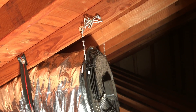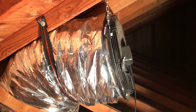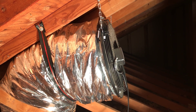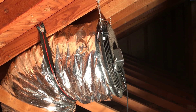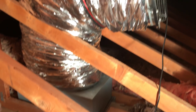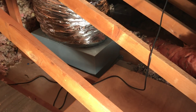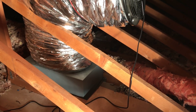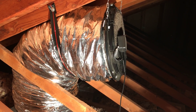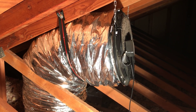As you can see, the fan is suspended — there's a chain here and a strap. The idea is that by hanging the system above the rafters, it supports the fan but doesn't shake the house. It's a soft connection down to your ceiling, so when you turn it on there's not a big vibration. Any vibration happening in the fan is just suspended — it's an isolation mount.